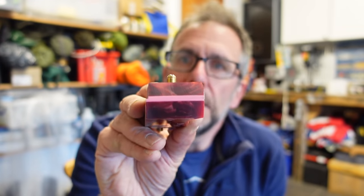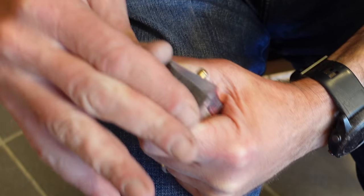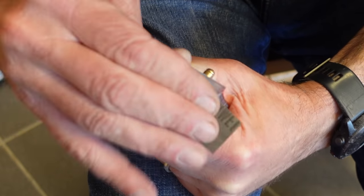That's got a really lovely finish just on that little mini disc sander I bought - it cost less than 40 pounds and it's just fantastic. I wouldn't like to do any really heavy duty work with it, but for something like this job it's absolutely perfect. I've just got some little strips of 600, 800, and 1200 grit - I'll just give some hand sanding to these ends and then get it on the buffer, and it should be to a nice finish ready for the glue-up.